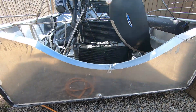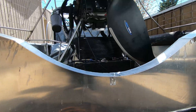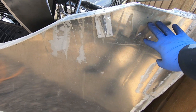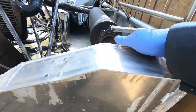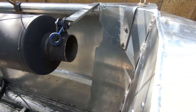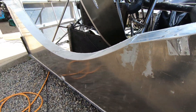The transom lip is finished. This was a nice, quick, easy step of the project. It's really very sturdy. I did have to move this bracket - I initially put it over here but had to put it there because the exhaust is going to come through here. The next step is bringing this stainless steel through here, and then I'm going to have a turn-down on this side. But the transom looks good - the lip is done.